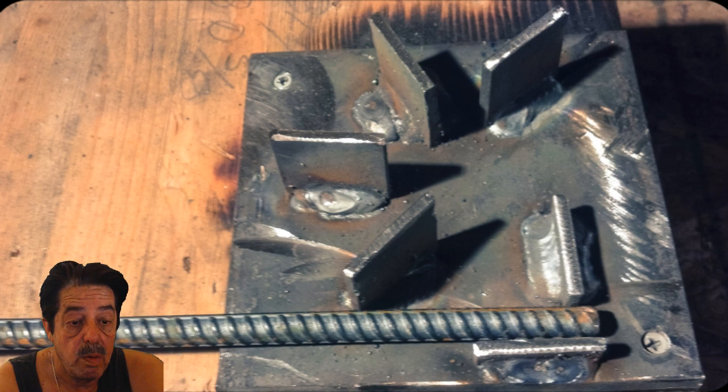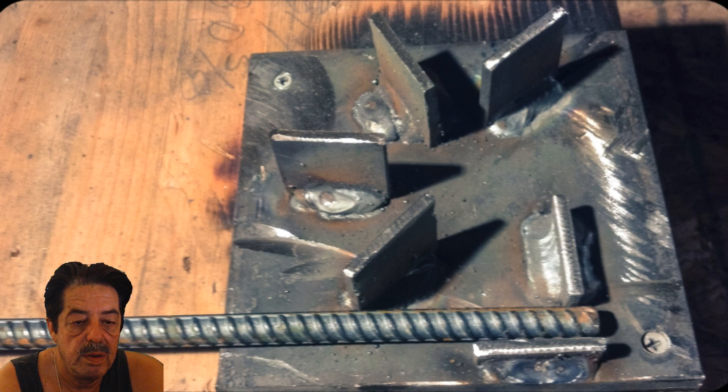These DIY jigs work as long as you do the work correctly. I used a compass. I can see all the grinding marks in the picture — we cleaned up the areas where we were going to weld and called it done because it's about weld prep. We went ahead and welded those tabs in there, and you use that circle to help align the vertical tabs. Once you have the circle drawn, you just decide how big of a circle or arc you want, scribe it with a compass or marker, cut the tabs, and weld them on good and solid.